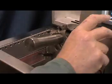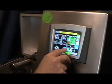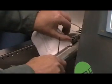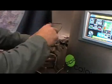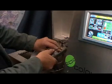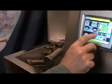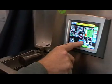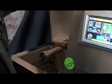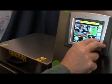So when we've got an operator call, we'd action the operator call and then use the inch button to get at the beakers and take them out and actually take the lid off and make any additions that we need to do. Reposition the beakers and move to the next one. Once all that's completed, you just close the lid and press the step on, which would move it to the next step.